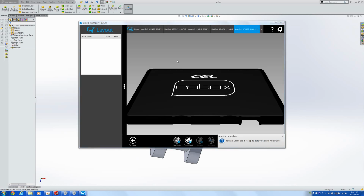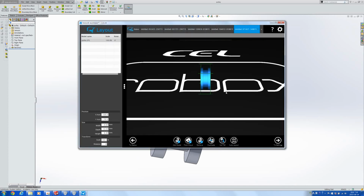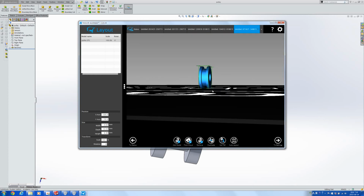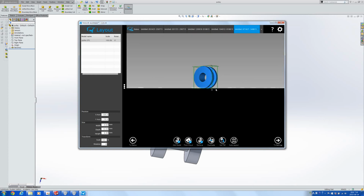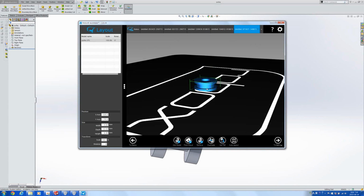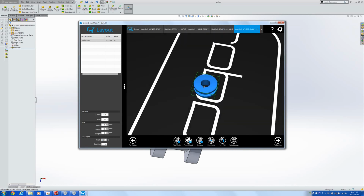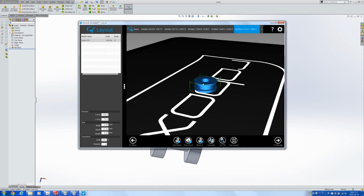And then if you're trying to print out something like that pulley, a problem might be... So first, you try to print it like this. You're going to need a lot of supports, especially for the center of the circle, and also the edges. And also, if you lay it flat again, you're going to need supports to keep the flanges of the top open. And usually, if you use supports, the parts end up not looking that good.